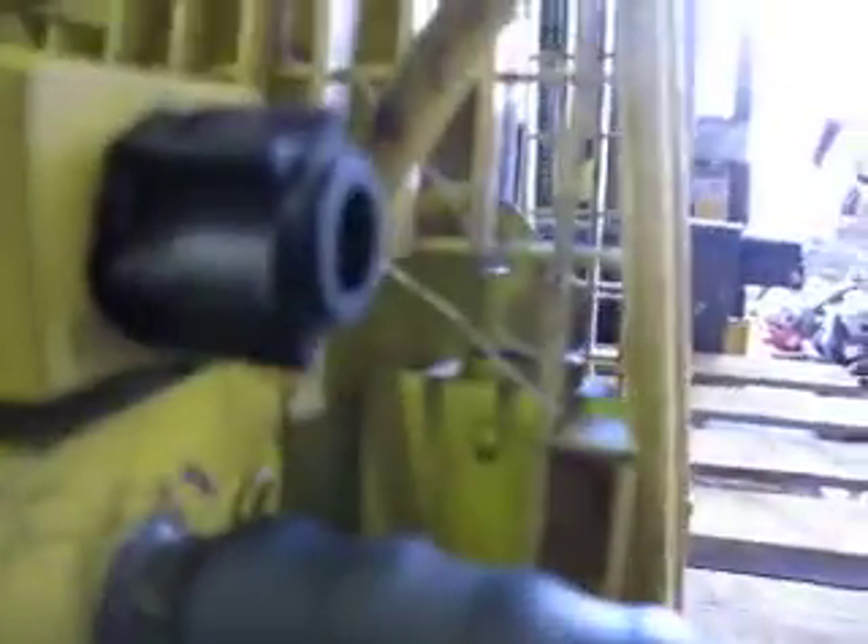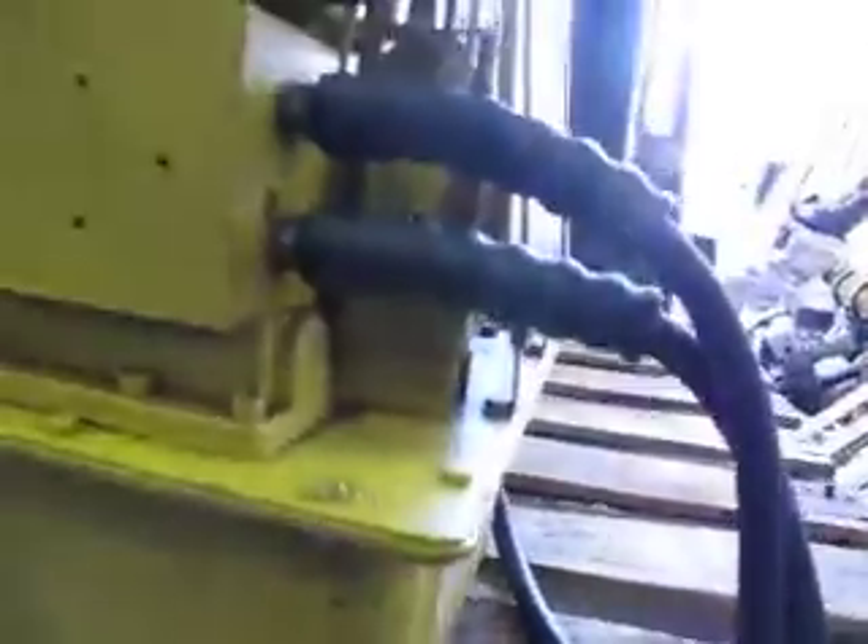That's a relief valve — here's the valve here. You can externally adjust them so you don't blow out your machinery, whatever you're using. He's recommending to his men 2,000 PSI, and he's got the relief valve set to 4,000, but you can take it up to 10,000 depending on what you're doing with it.